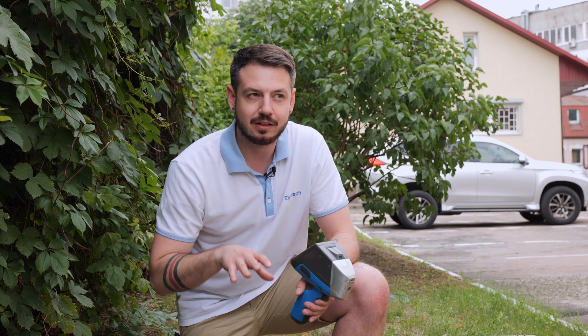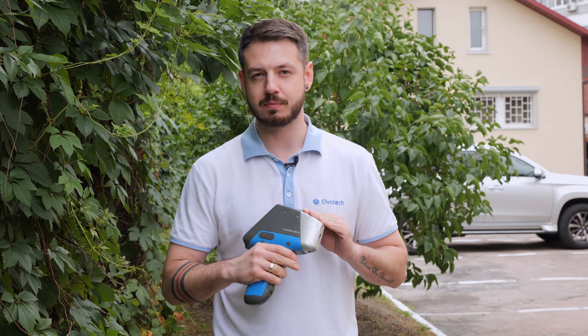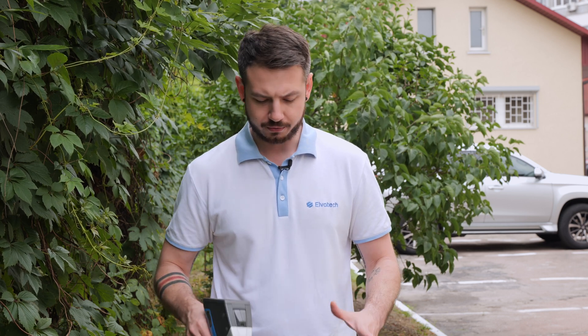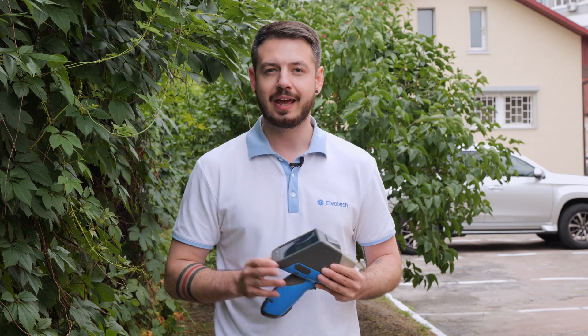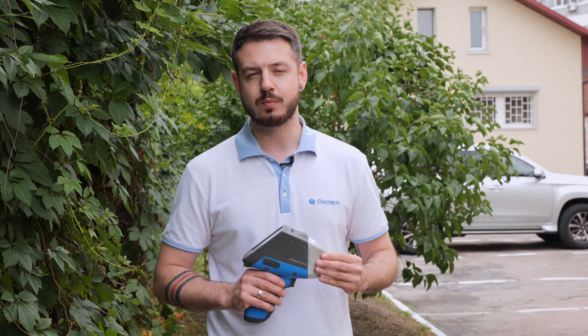But in all three spots the leading element is different. As you just saw, this is how to perform a fast soil screening using the portable spectrometer. We had just a one-meter diameter area of soil and we took three different analyses. All analyses were pretty similar but in all three we had a different base element. We need to understand that this is just a fast screening — however, if you find anything suspicious like dangerous or toxic elements in the soil, it's required to make a deeper and more reliable analysis with a laboratory spectrometer.